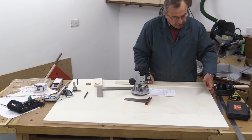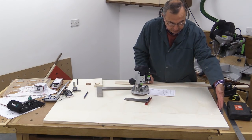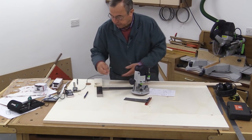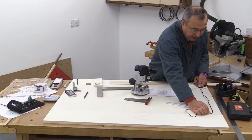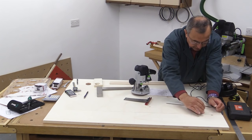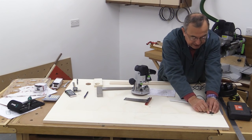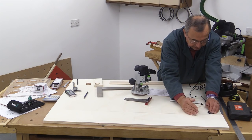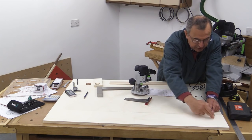I'm going to have the cable running in a channel along this edge, and that's why I need to do this before the edging strip goes on. It's slightly complicated — if you imagine a cable buried in here, somehow you've got to join it to another piece. But we've got to veneer this, put edging on and so on. So I'll need some sort of reservoir for the cable hidden inside here until the veneering is done and it's all cut to size, and then I've got to be able to get at it and pull a bit out so it can be joined to the other piece.